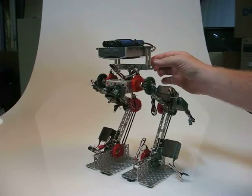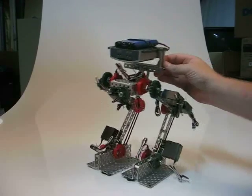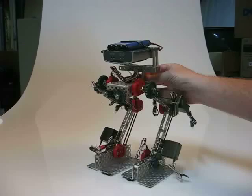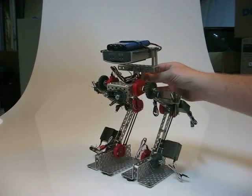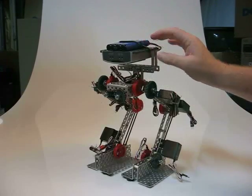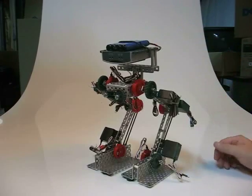We're going to adjust the center of gravity and have the robot rock back and forth by the head movement. The head is mounted on a four-bar or four-link mechanism right in the back to allow the head to rock back and forth and move the center of gravity. The battery is placed on top because we want that weight to shift the center of gravity.